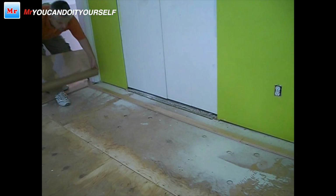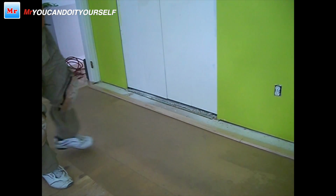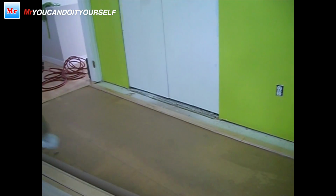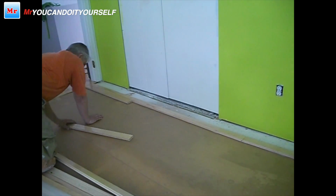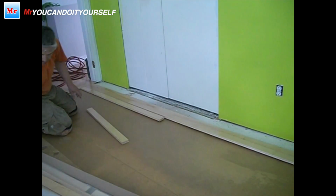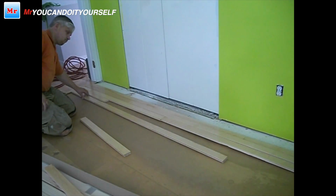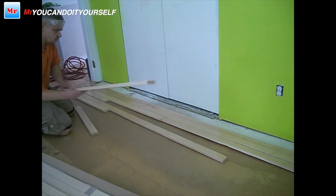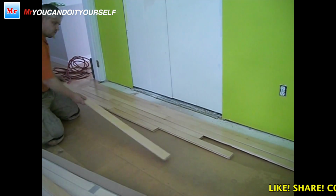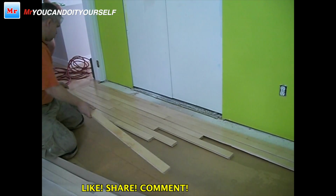First of all, I put wax paper. Wax paper is needed for easy board sliding over the subfloor, because if we don't use wax paper, it's very difficult to slide boards, and it can be squeaky later when wood is touching other wood. But with wax paper it's very easy and best. I start staggering the wood, and in the next video I'll show you how to start and finish this whole master bedroom.